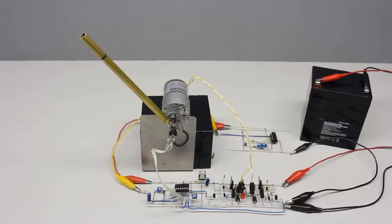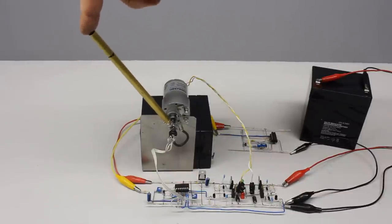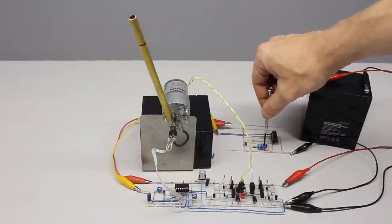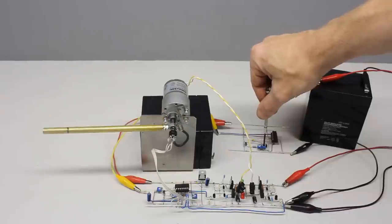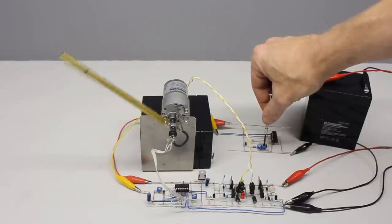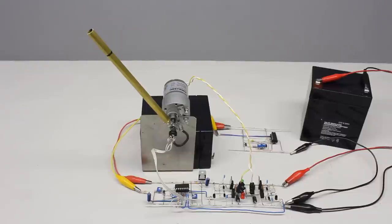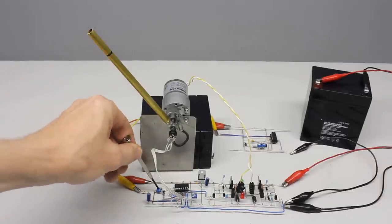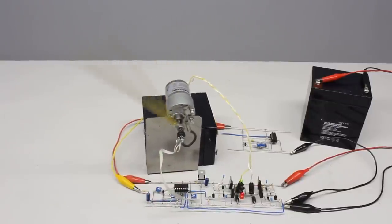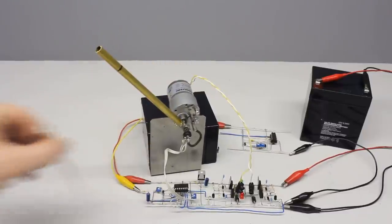There are some combinations of electric motor and transmission that bring the circuit to its limits. Here you can see a compact geared motor with an overall gear ratio of 30 to 1. There is some clearance caused by the gearbox, affecting the whole system unfavorably, making the positioning very rough. When lowering the voltage range of the window comparator to get more precise positioning, the control loop oscillates and the lever starts oscillating. Besides the clearance, the high inertia of the long lever further boosts the tendency to oscillate.